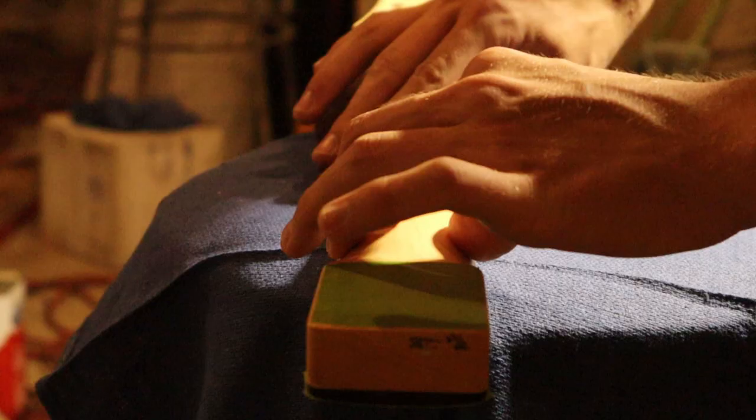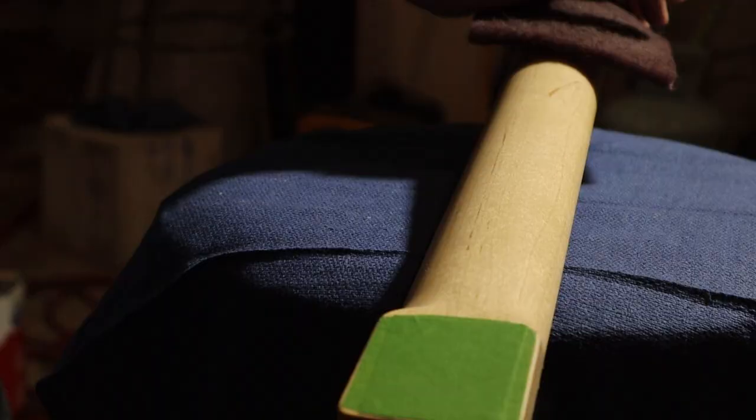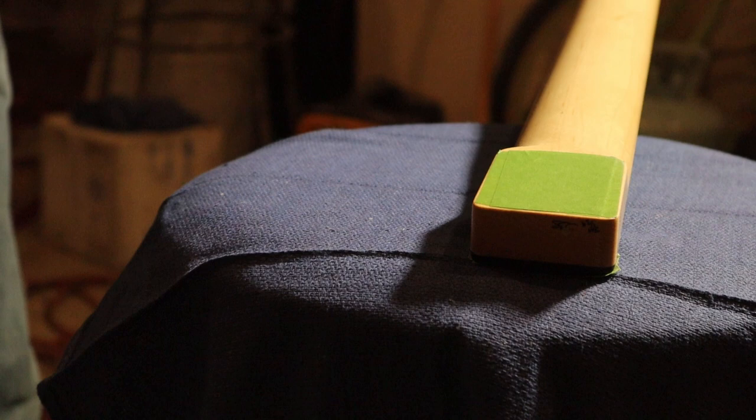And for the neck, I actually didn't have to worry about sanding the finish off to bare wood because I chose to just scuff it up with some Scotch-Brite. That's actually all it took to get the vintage amber lacquer to stick. And I'm glad that was the case because I was kind of worried about how I was going to get the logo to not sand off. Just using Scotch-Brite was such a gentle abrasion that it didn't cause any issues.